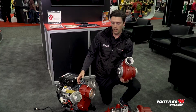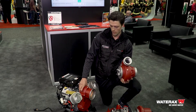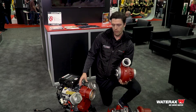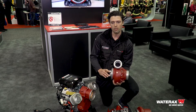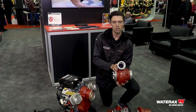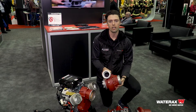Both these pumps are powered by our belt-driven speed increaser. This acts as the buffer between your engine and your pump end — it increases the speed to spin the pump end and it will protect your pump end. If something was to get sucked up, that belt will fail and your engine will be safe.